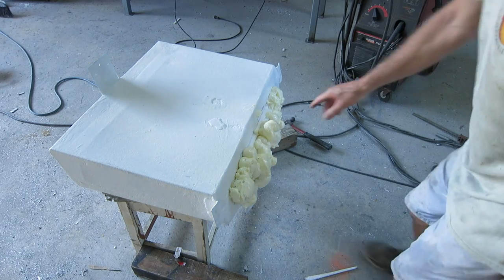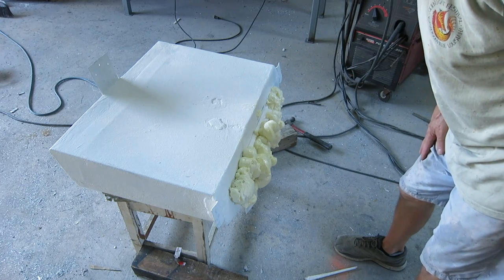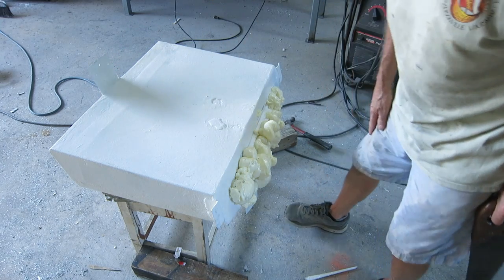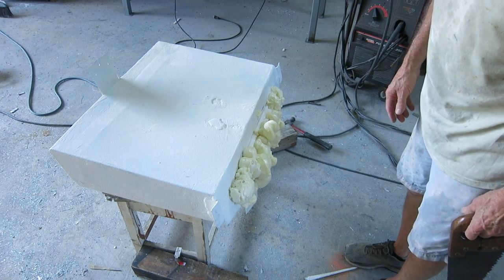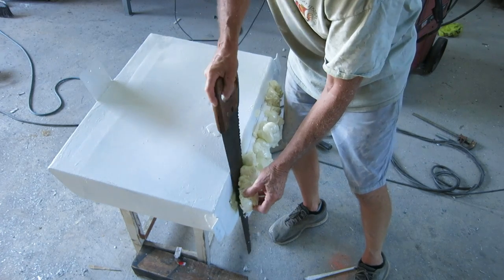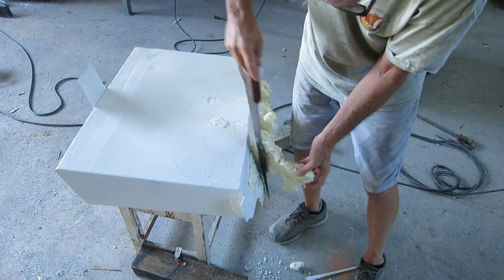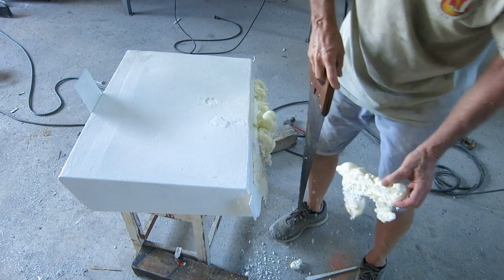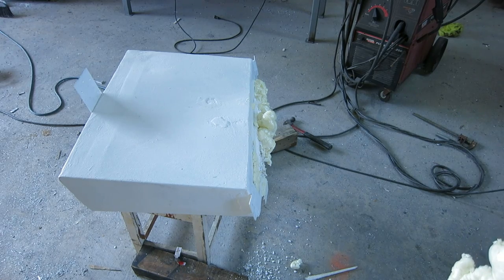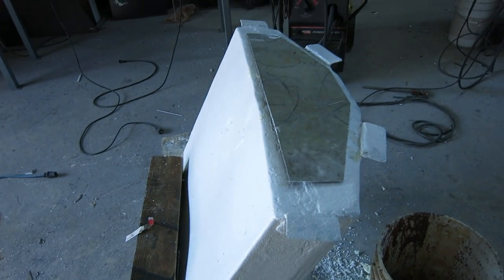It's been a couple of hours and the foam has calmed down, but it's actually pushing some of the white sheets of rigid foam out - which is awesome. That means I've got foam all the way to the bottom and it's expanding and pushing out. I'm going to trim this stuff off and fabricate the plate to seal this bottom up. I'm going to glue and pop rivet it into place - I can't weld on it. I've cut my last piece of metal, which is the back - or the front - of this little floaty.